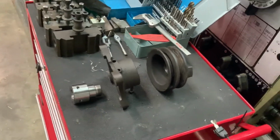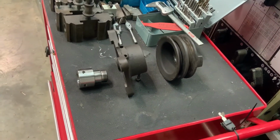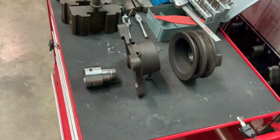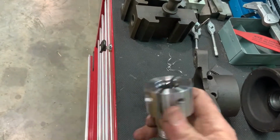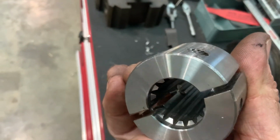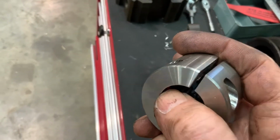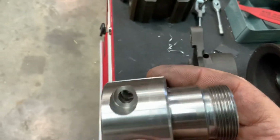When you lose drive on a Husqvarna PT26D, when it won't drive either forwards or backwards, it usually means that the drive to the hydraulic pump for the hydrostatic drive is no longer functioning. And it all comes down to this piece here. This slots over the shaft of the hydraulic pump, and there are splines inside. What happens on early models is that this part was made in cast iron and the internal splines strip, so that there's no drive through to the hydraulic pump.